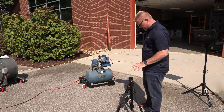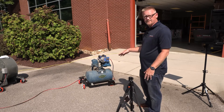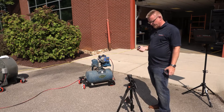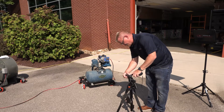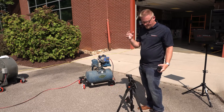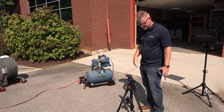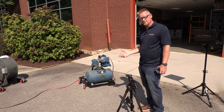When we set the tripod up, it's variable height, but we want to try to stay as perpendicular to whatever we're taking video of as possible, so we're going to keep it pretty low. We're going to start with the 25 millimeter lens, figure out our distance, input it into the laptop, and then see if we need to zoom in further to pinpoint an anomaly. Where we're placing the tripod is really based on where it's convenient, simple, and safe for you inside your plant — it's not necessarily a specific distance from the unit. The lenses will help you zoom in as needed.